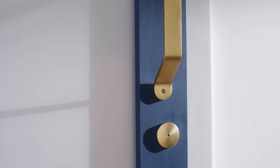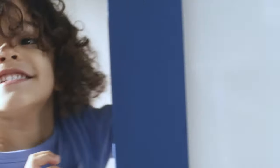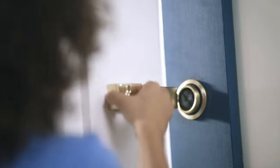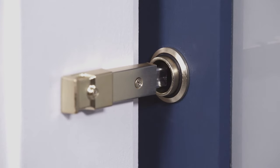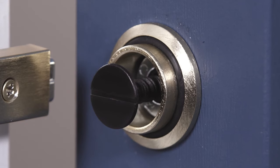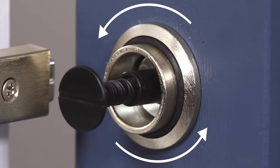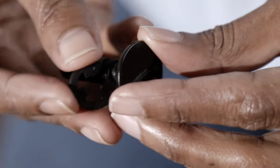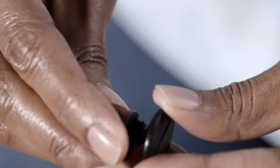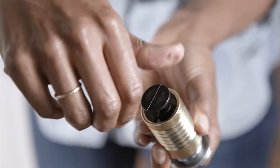One of the best features of this lock is the emergency release button, which gives you access to the door from the outside if it's accidentally locked by a child. Test it out to make sure the actuator extends far enough to extend and retract the latch bolt. If it's not quite hitting, you'll need to adjust the strike flange. Press and hold the emergency release to extend the actuator, then lengthen it by twisting counterclockwise. Move the clip onto a groove further back on the actuator shaft, then twist the actuator face clockwise until it's fully tightened.